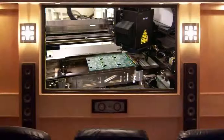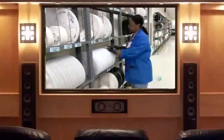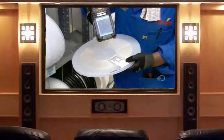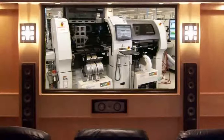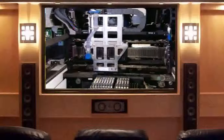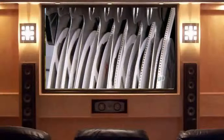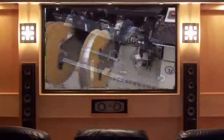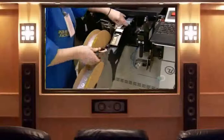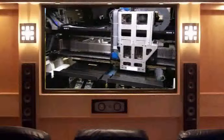The next machine's two lasers verify that the solder paste application is perfect. Depending on the size of a specific circuit board component, there can be anywhere from 5 to 20,000 of them stored on a tape reel under a transparent protective strip. Workers mount the reel for each component on a pick-and-place machine — a computer-controlled high-speed device that peels back the protective strip and picks the required parts off each reel, placing them in their designated solder-pasted position. Bulkier components are stored on a different size reel, which workers mount on another type of pick-and-place machine that operates more slowly due to the larger size components.